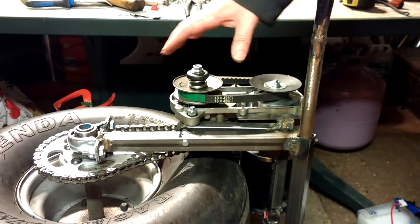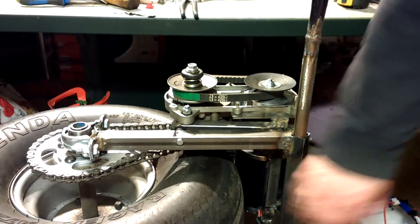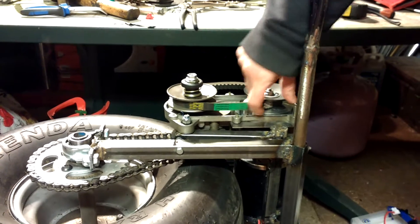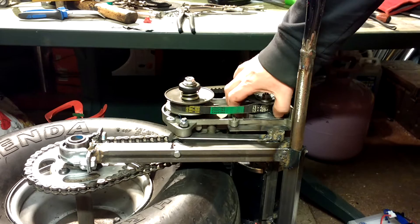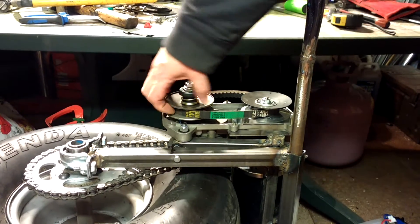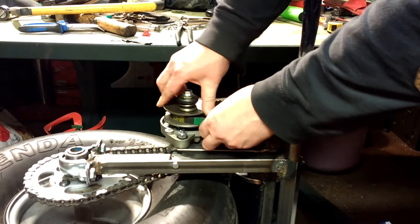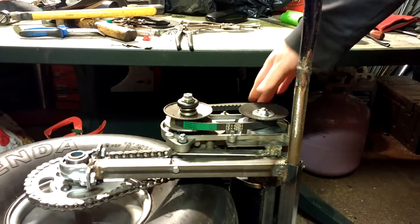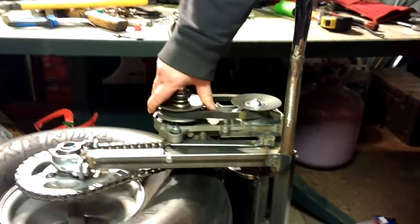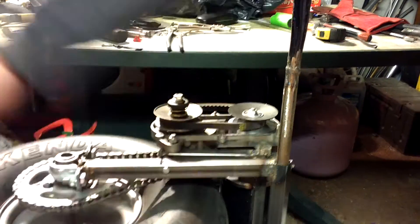This is the unicycle with part of the lower frame assembled. What should happen is this motor should turn this drive pulley in this direction. The weights in here should be flung out, which would push this up, so the belt should ride out on this pulley and go in on this one, and this one should come up against the spring here. In effect, it will go from a low gear to a high gear and then turn the wheel in this direction.